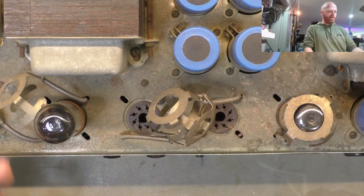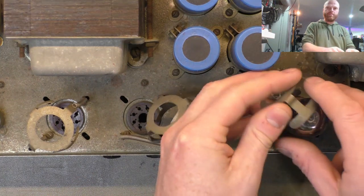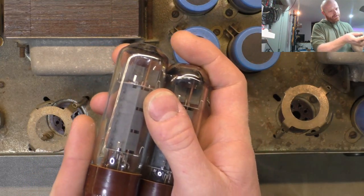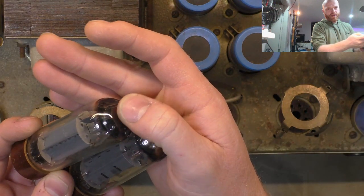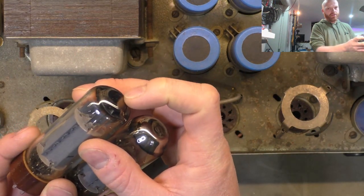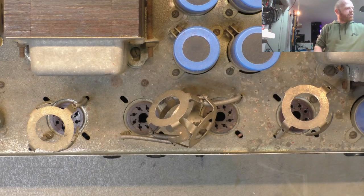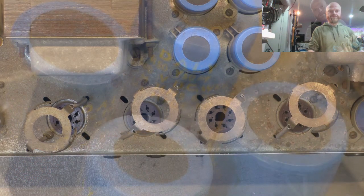Onto the output valves - this might have been an attempt to run the thing at 50 watts, which is doable but you've got to match the impedance on the output. We've got Svetlana tubes dated 02/09 - not sure if that's 2009 or 2002. The getter flash has pulled back on one and it's pretty see-through in that area, which usually indicates it's run too hot or it's slightly gassy. I've quoted for a full new set to return it to 100-watt operation and have a fresh set of valves as a known starting point.